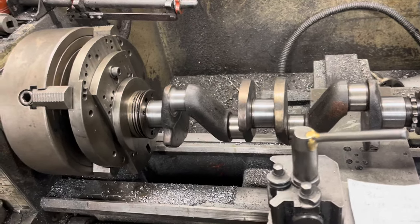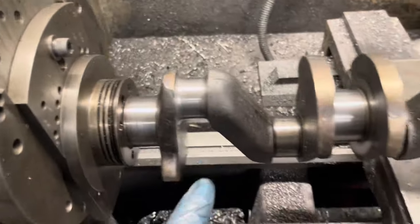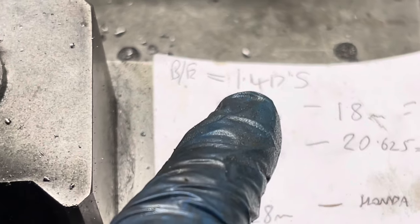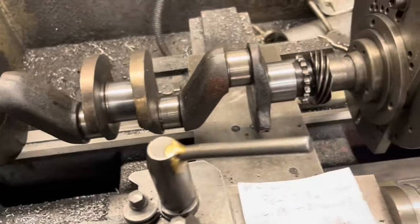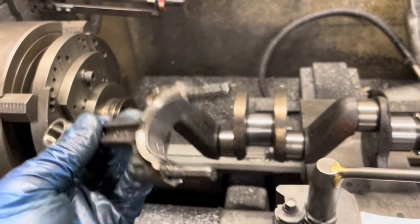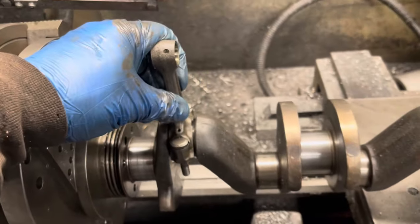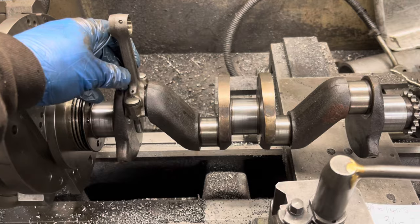At that point we're going to get a dry build tonight, which is what I wanted to achieve. I've got my conrod here and my crankshaft. I've just machined the first journal. My 36mm basically comes out at 1 inch 417.5 thou. What I've done so I can get a dry build is made this 5 thou down from that — so mine's 1 inch 412 — because I'd like to get 10 thou shells in here. I wanted to do a dry build before I start buying anything or spending any money. This will now go straight on — a bit of clearance, which we'll have to take into account when we do the pistons.